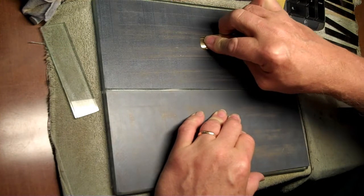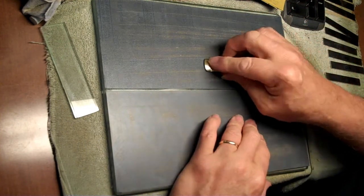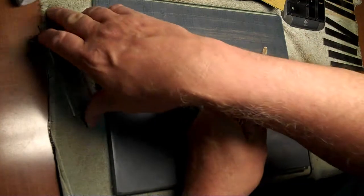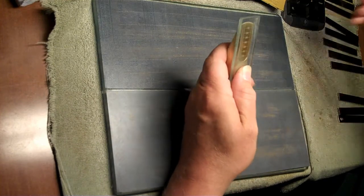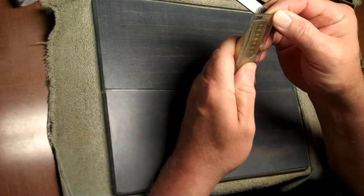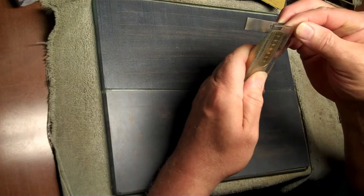Open the tip a little. Needs to create a little thicker tip rail anyhow. Which way did I have to lean it? Said I had a high spot here, but now that I've worked on it a little bit, I should double check that. My larger feeler is a 93 that I used on this facing. I have larger feelers than that. That's the largest one that I could use here.